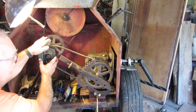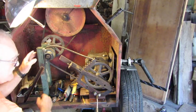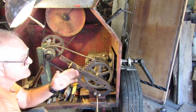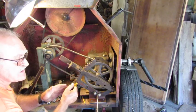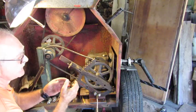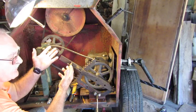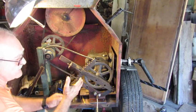So I'm going to go ahead and use this right here. I just had to size the pulley to where I could still come up with the same calculations. Now, because my tractors — the ones I'm planning on using — don't have a clutch, they're hydrostatic. Whenever you engage the power takeoff, it engages with a jolt, even at an idle. So there's going to be a shock factor there. If this thing needs to be started and you've got a full load on it, you're putting a tremendous shock on that entire drive train, so to speak.